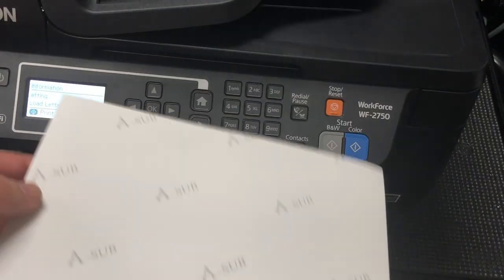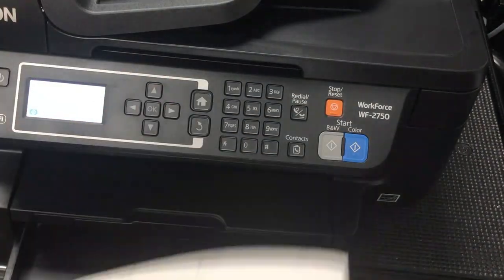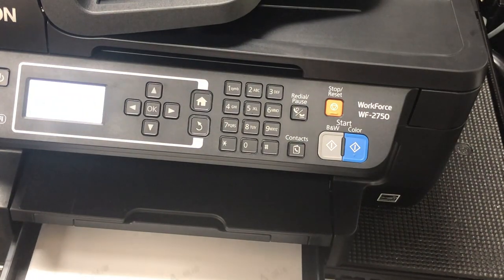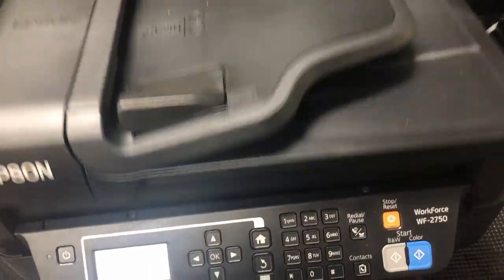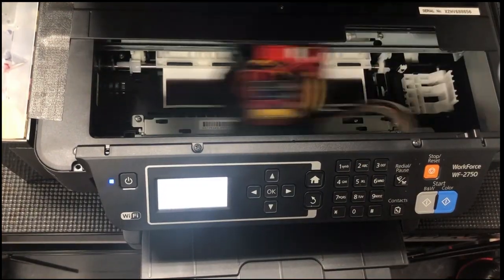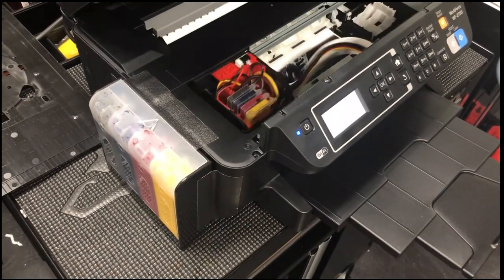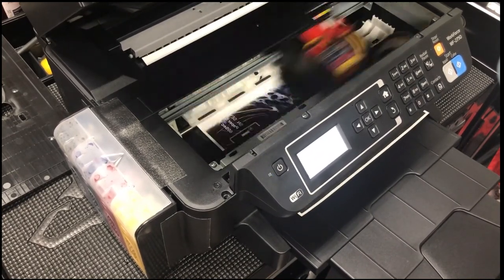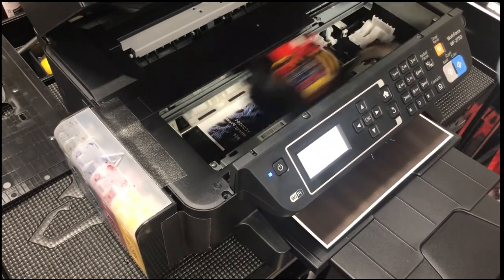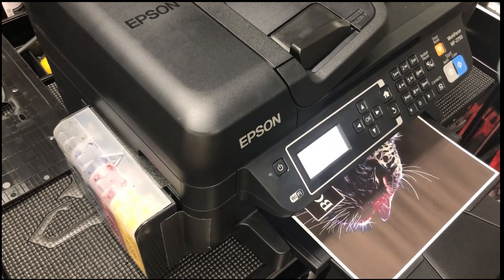Now we've loaded the paper in. Remember, the paper will be turned around and printed like this — the uncoated side faces up. You might notice this is different from Dr. CIS; it doesn't have all the tubes hanging everywhere. We pretty much designed this for sublimation — we print a lot and don't want to spend time unclogging. We made modifications to the traditional CIS, including a two-stage filter, a bubble remover, and a pressure regulator. The small box is a pressure regulator that removes bubbles to ensure smooth printing.